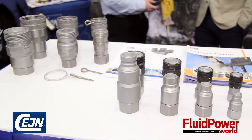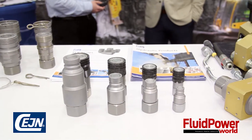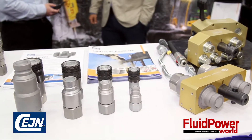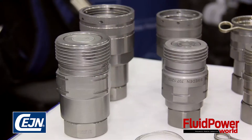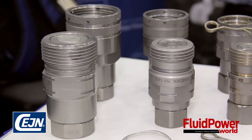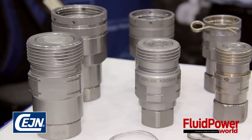I've seen a few of these couplers throughout the show, but my question is, are they good for all applications? While they're a good product, they're definitely not suitable for all applications. Some applications have excessive vibration, a lot of surging with the hydraulic oil, and in those applications you need a heavier-duty style coupler.